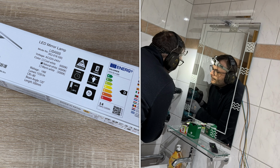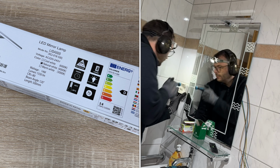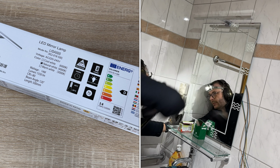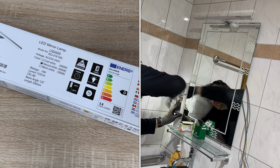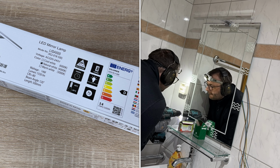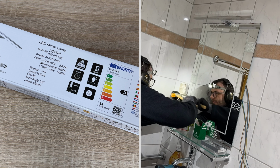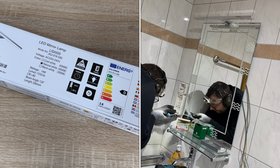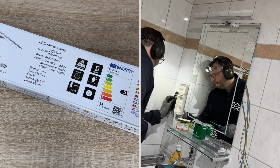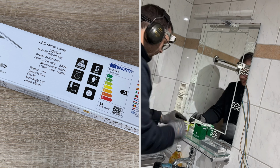That's really cool. With lights with a color rendering index of more than 80, we may be able to detect the color definition of the object, which helps our aesthetics and our choices. If we want to enjoy a high quality life, we need to choose lamps with a color rendering index of more than 80 to make our eyes and mood comfortable.